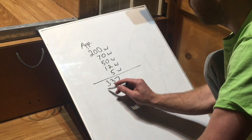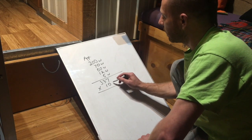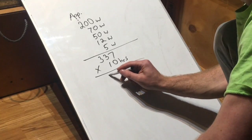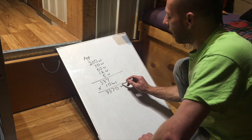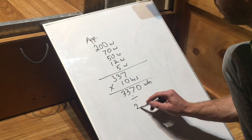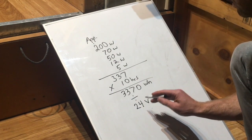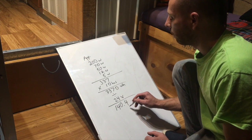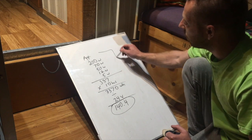Now what you want to do is take that number and multiply it by 10, okay? That 10 represents 10 hours — you want to act as if you're running all this for 10 hours straight. So you get 3,370 watt-hours. Take that number and divide it by 24 volts, which is our system. If your system is 12 volts, you'd put 12 in there. You're going to get 140.4, and that number is your amp hours — that's how big your battery should be just to run this stuff for 10 hours.